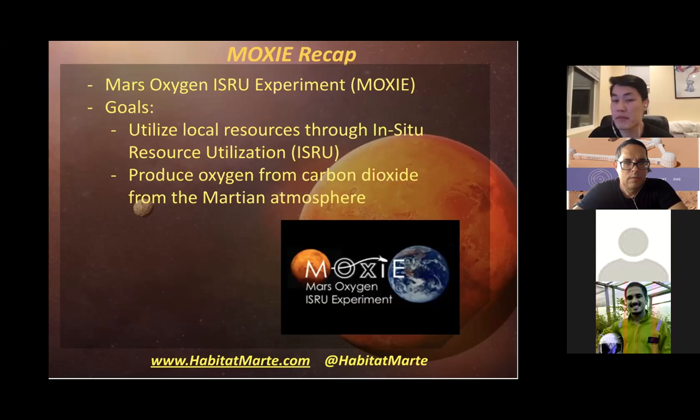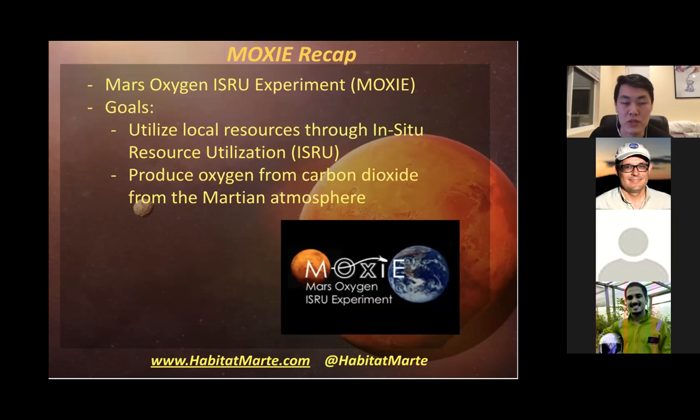So just to recap, MOXIE stands for the Mars Oxygen In Situ Resource Utilization, or ISRU experiment. There are two primary goals: to utilize local resources on Mars through in situ resource utilization, and to produce oxygen from carbon dioxide from the Martian atmosphere, the carbon dioxide being the local resource and oxygen being our desired output.